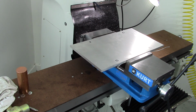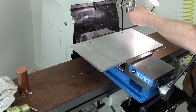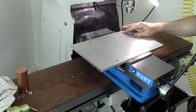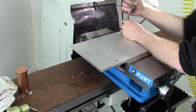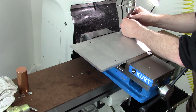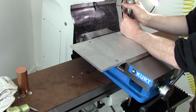So we got put in our drill chuck. Okay, I think I've got a pointy edge finder I'll use. I could just eyeball it. I got 25 thousandths clearance between the 1/4 inch hole and the size of the bolt, so they don't have to be super close. I'll be right back. I got to hunt up. Never mind. I don't have to hunt it up. It was right here. So we'll put on one of these little pointy edge finders, and you put it in, move it around, get pretty close. I don't have a regular wiggler. It's on my list of, along with about 1,000 other things that I'd like, but don't use it too much.